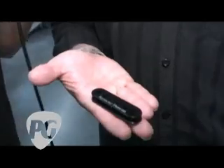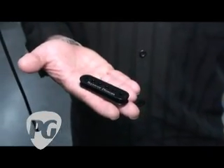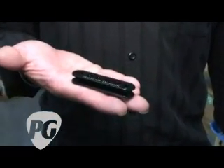So this looks like a single coil to me. Actually, this is a humbucker bobbin. This is different than the single coil bobbins, which were hand fabricated. This is a bobbin made of a material called polycarbonate. It comes out of an injection mold, but like the single coil bobbin, it will serve the same function — it'll get wrapped thousands of times with very thin copper wire to create the coil. And then ultimately, you put two of them together, and the hum gets canceled.